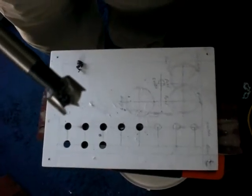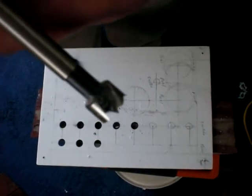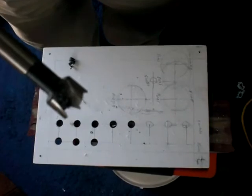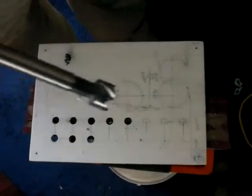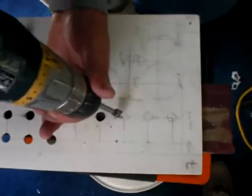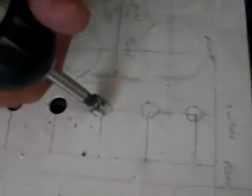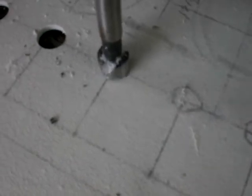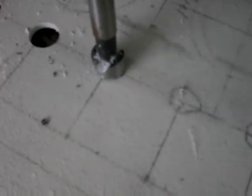We're going to go ahead and drill a couple of these while you're watching so you can see how nice and clean a Forstner bit can drill bore through these somewhat tricky plastic parts. I'm going to line that point of the Forstner bit right up with the X that I made where I want to locate my hole. Notice that the bit is not traveling at a very high speed — I don't want it to melt the plastic.